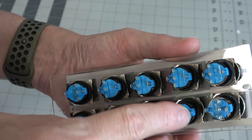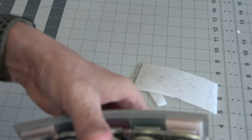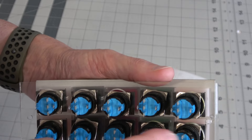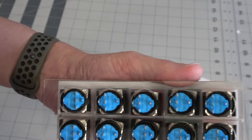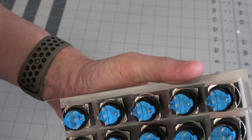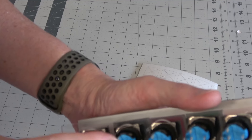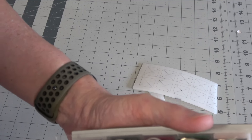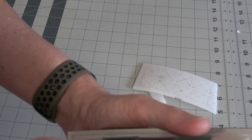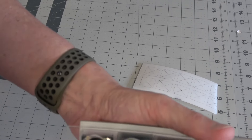Because the terminals are on the opposite side on some switches, when I wire this up I just have to make sure I'm on the right terminal. Just a little hint: when you're making your switches and putting them back together, make sure everything lines up so you don't have to crisscross wires later because of that. I wasn't paying attention there.